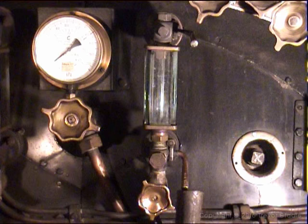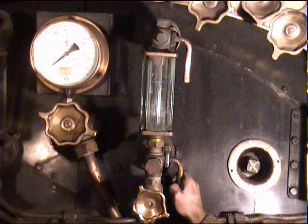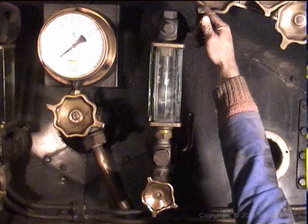If it was the other way around, like a lot of engines have it up there, you would battle to get that closed off. So do yourself a favor. If you can't get this one down because of various pipes, at least you've got that steam you can shut off, because the steam is the one that's going to do the cooking. So you check that there's water in the boiler, 3/4 to half. On a warm locomotive, you can go 1/2 to 1/4, and then you just give it that test.